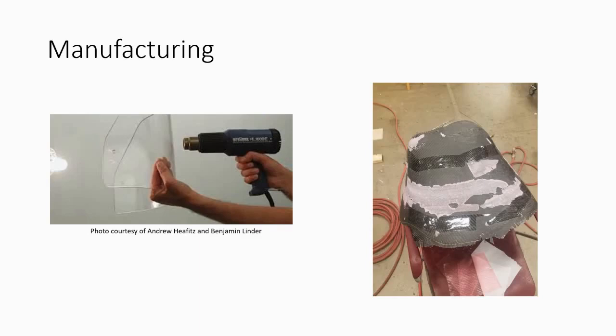The second was thermoforming in a vacuum former. Hulman did have a vacuum former available for us to use, and with a machine designed specifically for this task, it would be the most accurate in producing the exact shape desired. The third option would be to thermoform with a heat gun. This would be less precise, but it would get the job done. However, our research found that it may cause the sheet to bulge in places or warp the visibility.